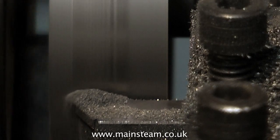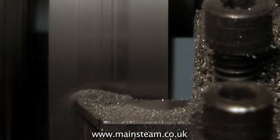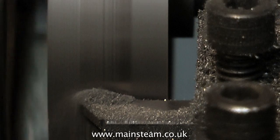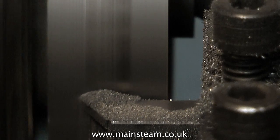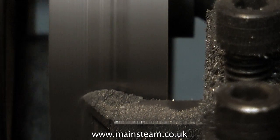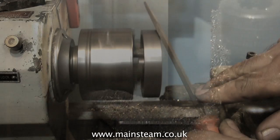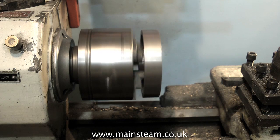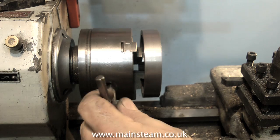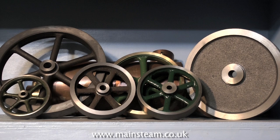You should also notice that the chippings are different — they're really piling up on the cutting tool now, and they're a different colour; even the chippings are grey. I must say though that sometimes, no matter what you do with the cutting tool, you cannot get under the chill, so it will be impossible to turn the part. In which case, as I've said before, either throw it away or return it to the manufacturer. This is looking okay now — I'm quite pleased with this for such a horrible flywheel. I'm using the file as before to take the edges off. So has it machined okay in the end — it's probably worth cleaning up the spokes and adding it to my collection of flywheels. Thanks for watching, and I hope you found it useful.